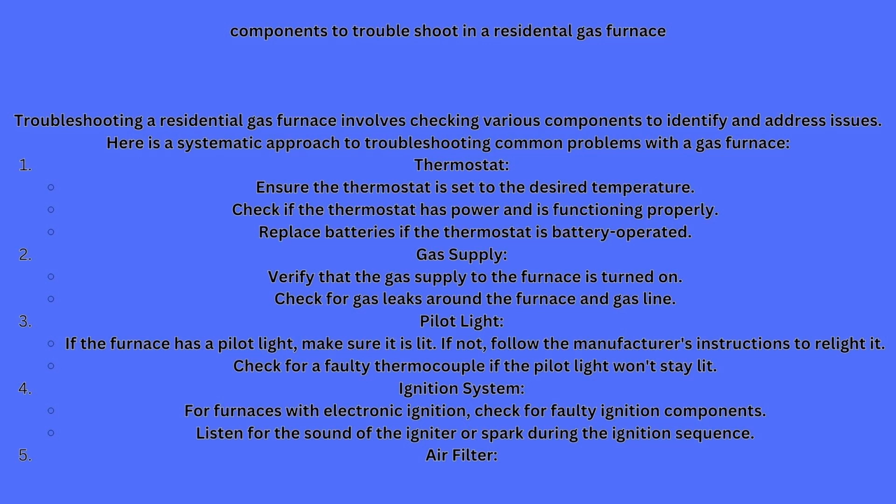Now, a lot of these thermostats nowadays are universal, where you can actually run another wire, which would end up being a 5 wire, off of your control board, which basically powers the thermostat directly from the transformer. It'll receive power from its common and R side, and it'll power it. How you check if your thermostat is receiving transformer power or 24-volt power is you go across your common and your R, and you'll get a 24-volt reading. That's how you know you're receiving 24 volts from your transformer and from your unit.